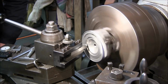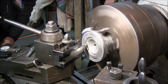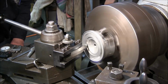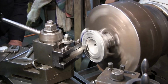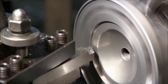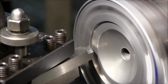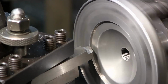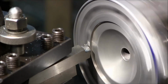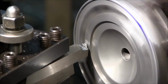Coming out. Okay, we're going to take 5. We're at 5. Still nothing. Okay, we're going to take 6. Okay, we took 6. We're coming out to see if we start skipping at all. Barely. Okay, we're going to feed it out right there. I like that because it's just like powderized, just barely there. Awesome, we're going to start seeing a trace on the whole thing.